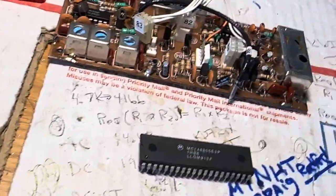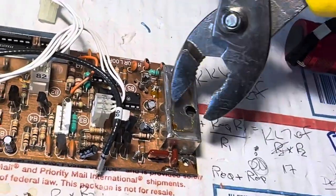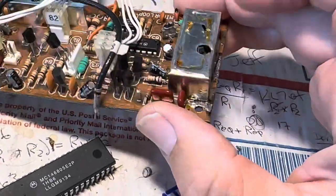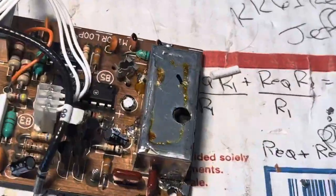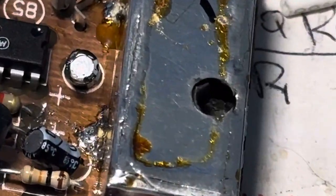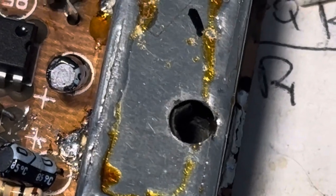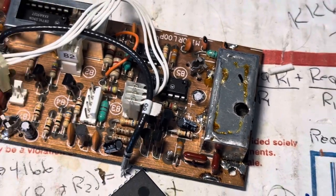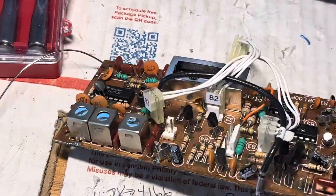I did even try to use some pliers on here lightly to see if I could break this cover loose and I couldn't. So there's still some solder holding it on. You can see how the gentleman who had this radio before did some damage to the form — the form is kind of broken there in the plastic. So it just depends where that slug is and if this minor loop will resonate. I may have corrected whatever problem he was trying to fix by re-soldering everything.